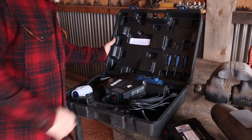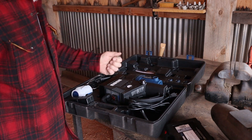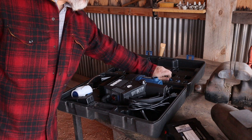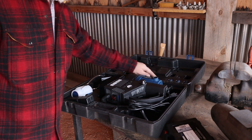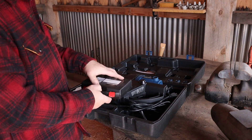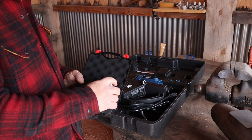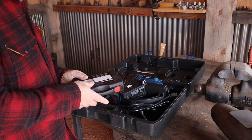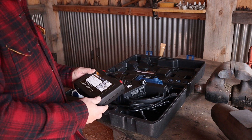It's got this really nice storage case. Instructions are included for the S28 mag drill. The drill is pretty much intact — the only thing you have to install is the coolant reservoir for your annular cutters, if you choose. The handles for the drill press are tucked away neatly, snapped in the lid. They also sent a six-pack of their annular cutters, all the way up to a one inch diameter. The S28 is designed to cut up to a one inch hole easily.